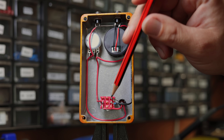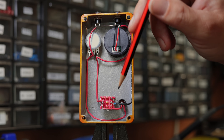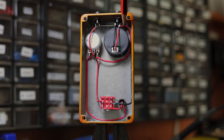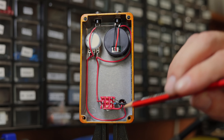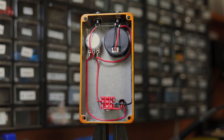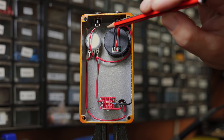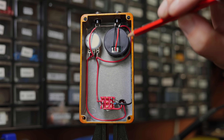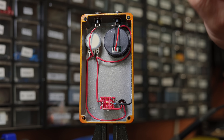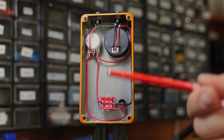The negative wire of the gauge connects to ground, so the gauge is always monitoring the output voltage. My incoming nine volts goes all the way around connecting to the LED, and from the LED that same nine volts connects to the bottom left lug on the foot switch. When the foot switch is pressed and the LED turns off, those two lugs get connected together, essentially bypassing the pot so it can no longer do anything. On the other side of the switch, the negative leg of the LED connects to the top right lug, and the center lug has a 4.7K resistor in series going to ground - so when the foot switch is on, the LED turns on. If you want to make it even simpler, just connect the input DC jack through the center lug of the pot to the output DC jack's positive lug.